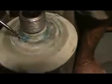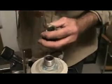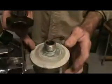There's a very good chance that this side here may be a pinhole leak up at the top, which the reason I say that is that this type of effect you usually see on the vacuum breaker caps that have failed, and it gets a lot of water. See, here's a lid. We have scale here, and we have a lot of coffee, but this scale right here, it could be just that this seal was leaking. And it was constantly cascading water down on top of the boiler, and over time it developed these scale patterns.